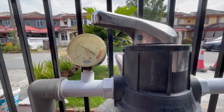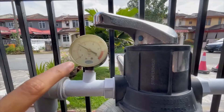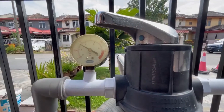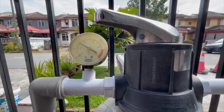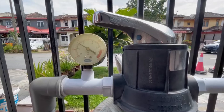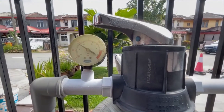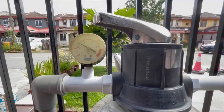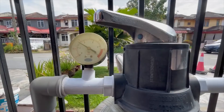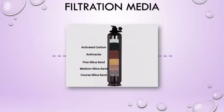This is the pressure gauge. For maximum working pressure, it is usually at 120 psi with a flow rate depending on the capacity of the tank. The pressure gauge reading increases over time due to accumulation of sediments from water filtration. If we discover that the pressure gauge reads higher than usual, that is one of the indications that we should backwash our filter. Based on manufacturer's recommendation, filtration media should be changed every 2 to 5 years, or whenever the pressure gauge is too high for routine function.